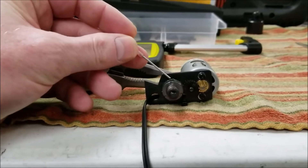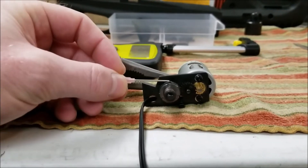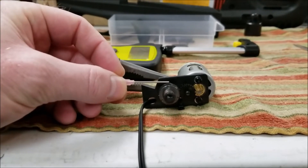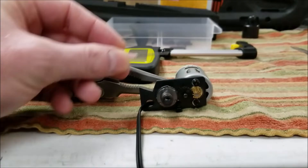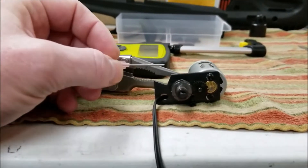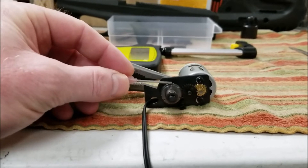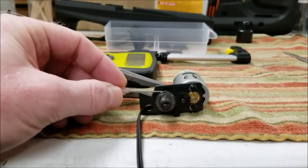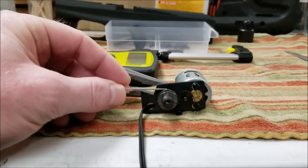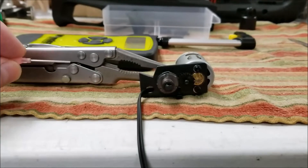Even before the washer modification, you have two of these little teeth on here — one on this side and one on the other. I shaved these down almost all the way, because if you don't, they'll just kick BBs off the auger. With the big motor and high voltage you can run them completely shaved down or without the BB shaker, but I found it to be a little more reliable if you have something there to shake it a little bit.